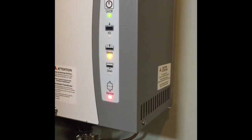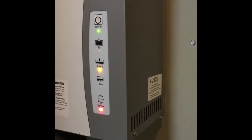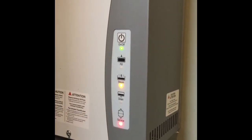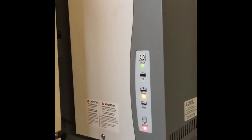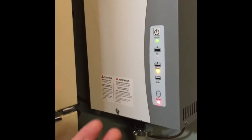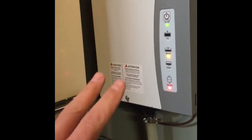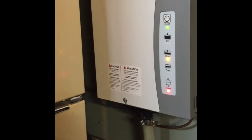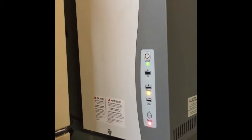Okay, I think that's based on time of run, run time, or maybe its own amp draw. I gotta read up on that, I can't remember. But we're going to pull the canister out of here, put a new canister in. So I'm assuming if the canister is all full of calcium and deposits, especially around the electrode rods, it's not going to obviously steam as fast. So, which is then gonna run longer and run up my electric bill.